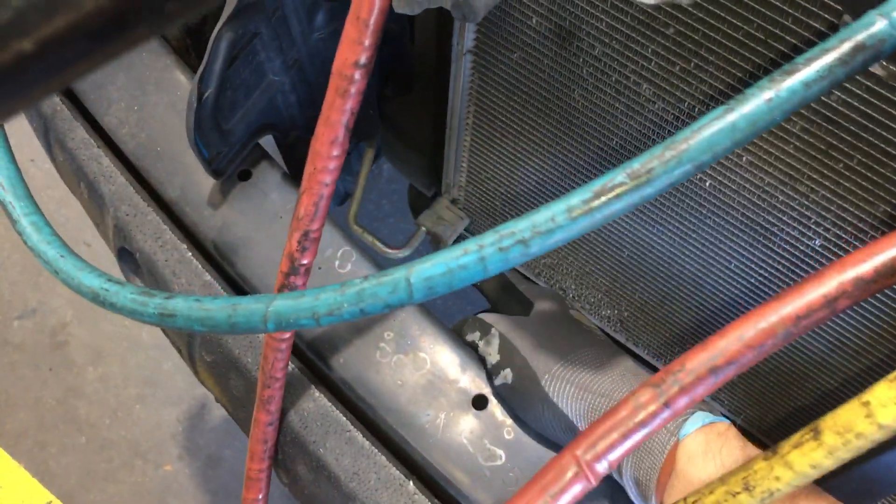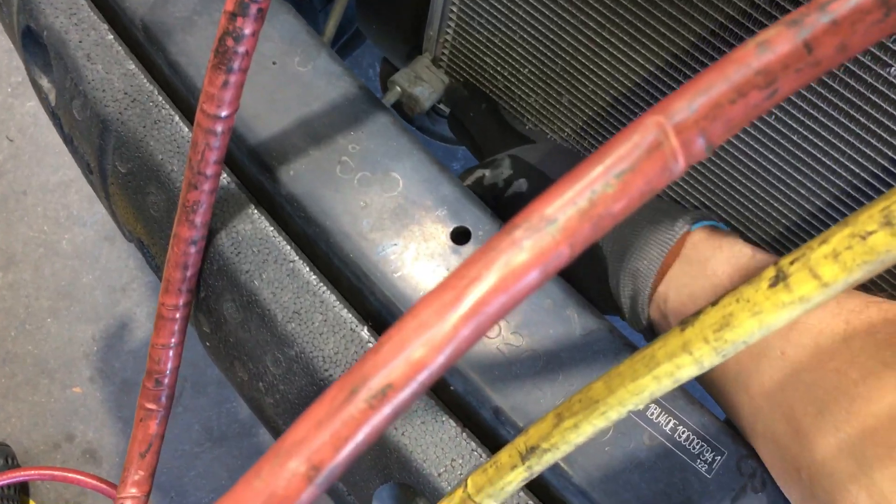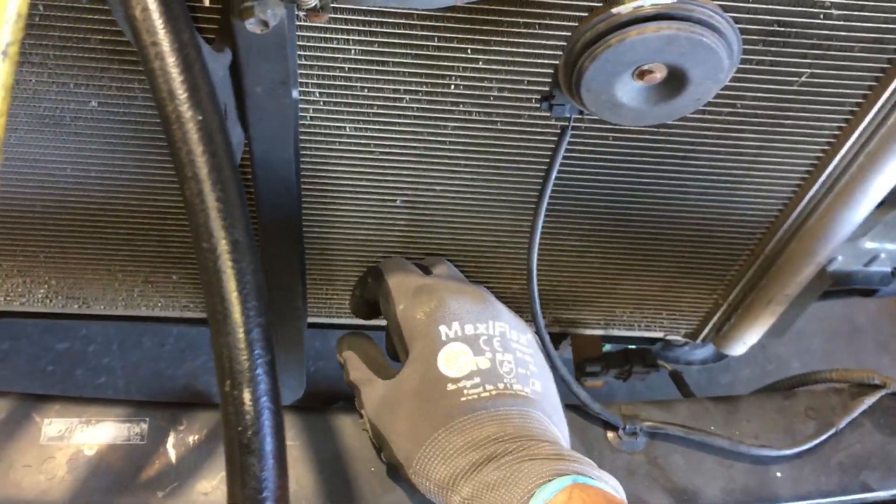Video 4 in this recovery procedure — I was interrupted by a job calling in on the other phone. So, let's get back to this. This is the sub-cooling circuit on this condenser. These bottom 4, 5, sometimes 6 rows of refrigerant passage tubes are completely filled up with a solid column of liquid.